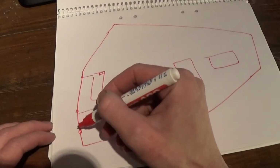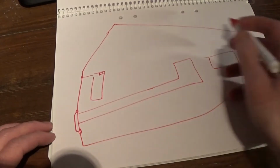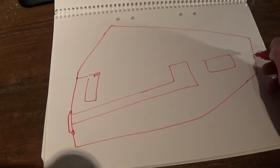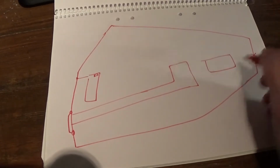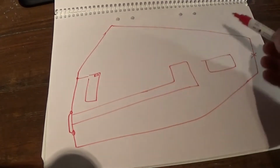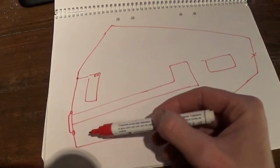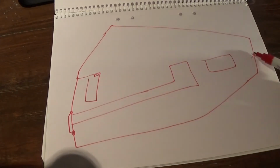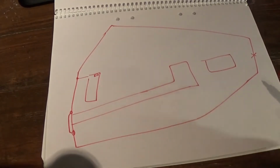That works, you can do that. What I've done is, as I said, I've buried a wire under the driveway that connects the fence. So my fence is a loop all the way around. And the reason why I've done that is that if the fence breaks up here, if a moose comes along and trips over the fence, and this has happened, and breaks the band up here, if I didn't have this link here, then only this half of the fence would have power going to it. This half of the fence wouldn't have power going to it. As it is now a complete loop, if the fence breaks up here, this part still has power going to it because the power is coming around this way. So you don't have to make a complete loop, but as you see, there is an advantage to making a complete loop.